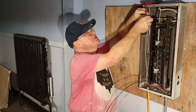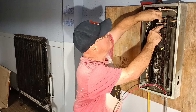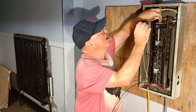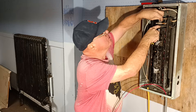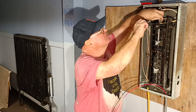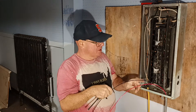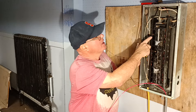This is a multi-wire branch circuit. We'll bring our white wire through the hole here, make sure the copper comes down through the hole, loosen our screw, and make sure all our strands come down through the hole. Make sure we don't get the insulation pinched. The BX cable here is being used as a ground, and the two circuits have to be on opposite legs of the 240.